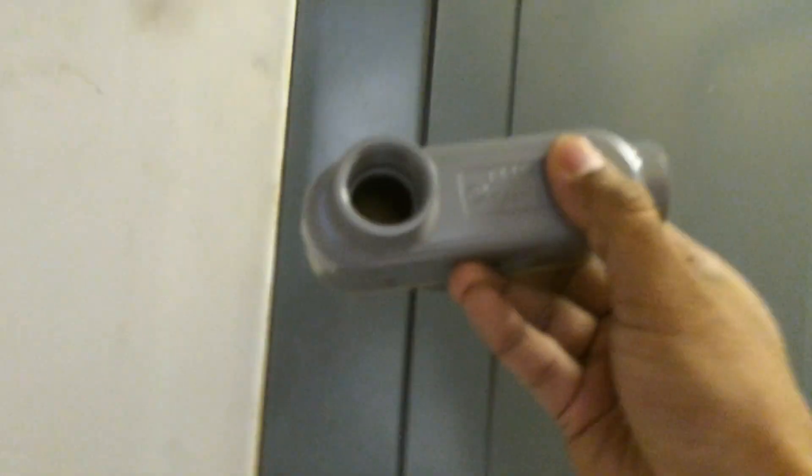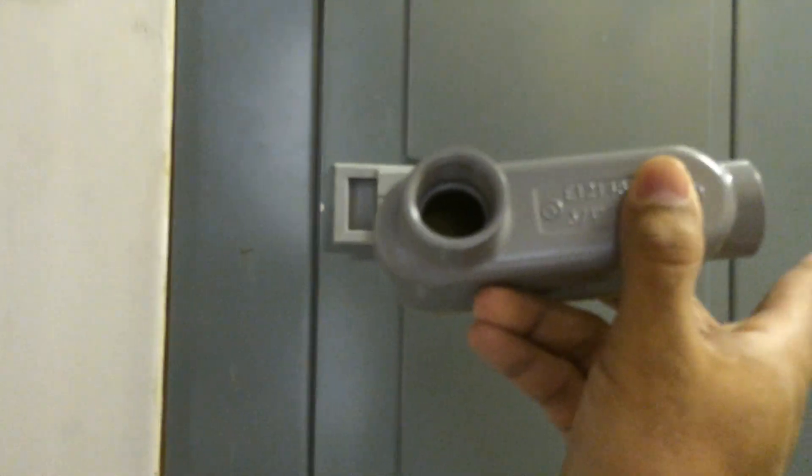As I go out of the house for the generator feed, the conduit is going to come straight up and then out. To take it out we're going to use a 90-degree fitting — this is the 90 that's going to push it out. Then this exterior 90 is going to catch the conduit and shoot it directly into the inlet box. Here are the compression fittings — these are compression couplings rated for outdoor use, providing a watertight seal.